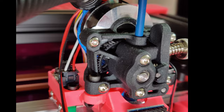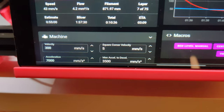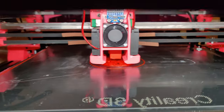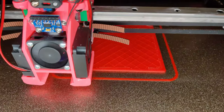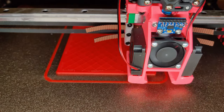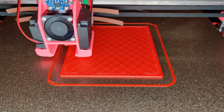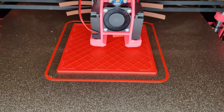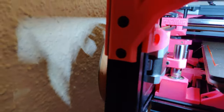I'm using a Sherpa Mini extruder and an E3D Volcano hotend. You'll always be able to print with faster speeds on a 0.4mm nozzle than with larger nozzles, but larger nozzles can make up for that loss of speed with the increased volume of material they can put down per second. For example, I'm using a 0.8mm nozzle on my Hypercube, and even though I have to drastically lower speeds from 250 to 60 millimeters per second for good quality, I'm still able to print large objects in half the time because it's outputting more material than a 0.4mm nozzle can.